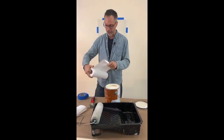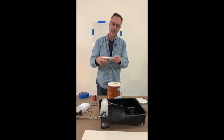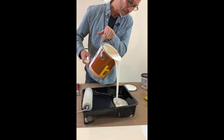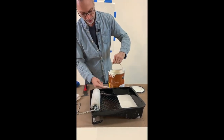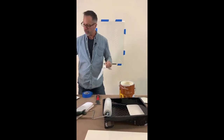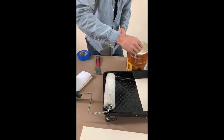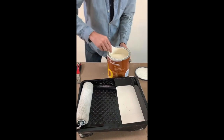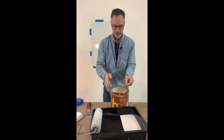If I'm using a brush, I'll have it handy and wipe the rim of the paint after I pour it. If not, I'll have a paper towel nicely folded up. Pour your paint into your tray, then wipe and clean the can. Fold the paper towel so it fits into the rim and curve it so it pushes the paint back in. Clean the rim. Now I can cover my paint and I'm good to go.